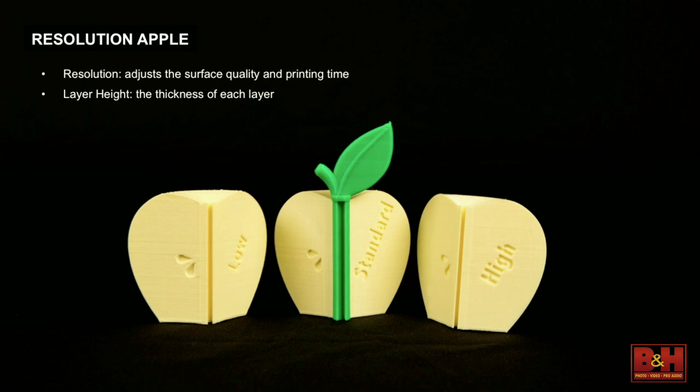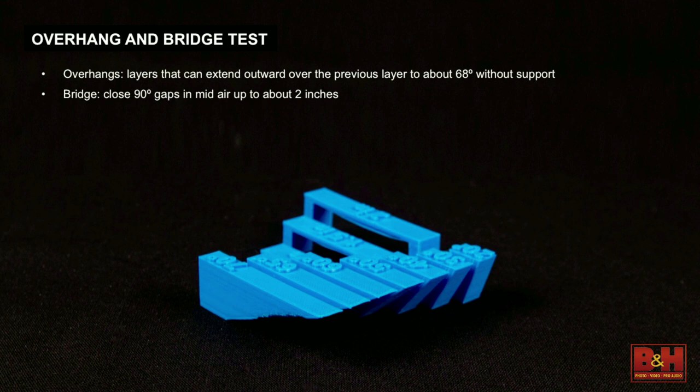The overhanging bridge shows design considerations you have to keep in mind when designing something to be printed. There are slopes of increasing angles from about 20 up to 70 degrees. You can see that at the 70-degree mark, the overhang starts to get a little choppy — that's right about the threshold where you might need support material underneath, because gravity starts to work against you. This model shows what happens when parts of your model are over that acceptable overhang angle: the version printed without support material is choppy and droopy under the petals of the flower, while the version printed with support material — which is just a checkbox in the software — comes out much cleaner after cleaning off the supports.